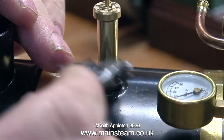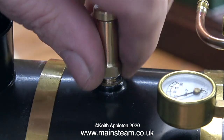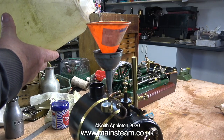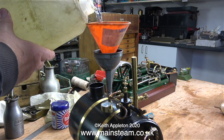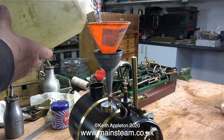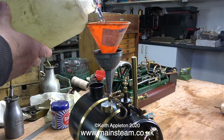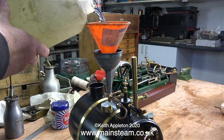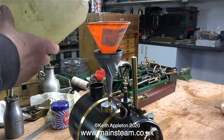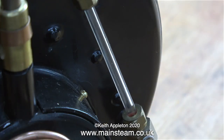I fitted this steam plant using the HB6 boiler with a large capacity hand pump, but in this particular shot I was testing the boiler on the workbench — the hand pump wasn't fitted, so I removed the safety valve and filled the boiler as shown. Here's a quick tip when using gas-fired boilers: you don't need to fill the boiler right to the top. Aim for approximately half a gauge glass full of water — that way you will raise steam quickly and may even have enough gas left to run your engine.